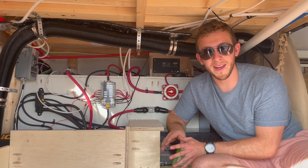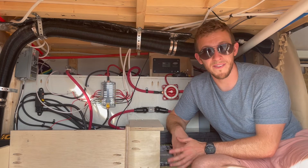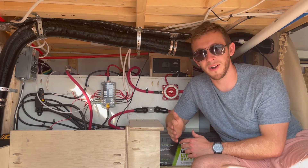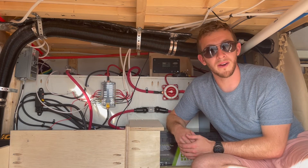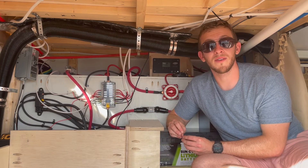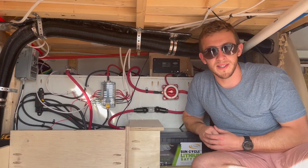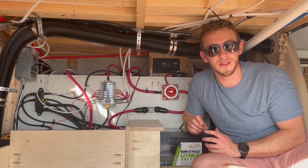From the inverter itself, you need to wire things a little bit differently — you need three wires, sometimes called 12-3. This is where we've converted from DC power into alternating current. For that, you need an AC breaker box, also called a sub-panel. These are important to be in some kind of accessible location so that if they trip, you can reset them, or if you want to make sure there's no electricity flowing to any electrical outlets, you can turn them off at your convenience.